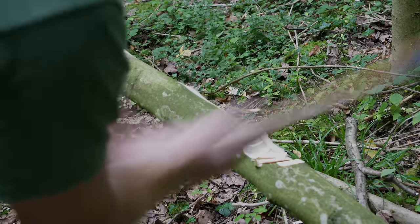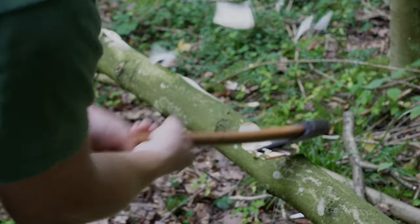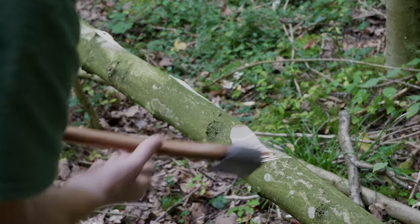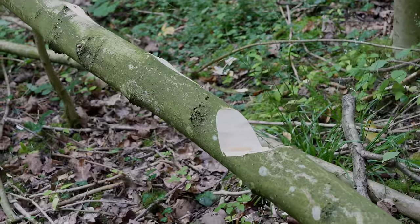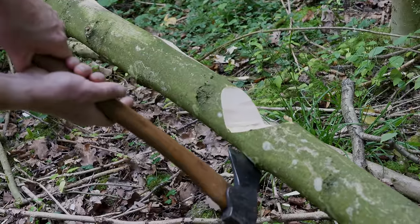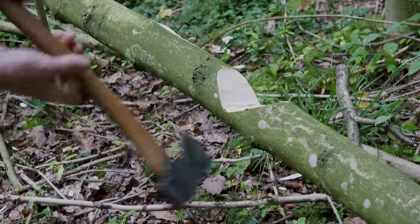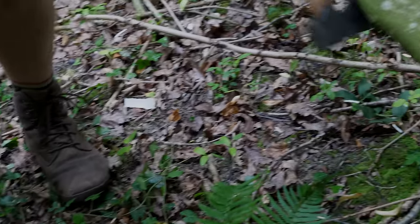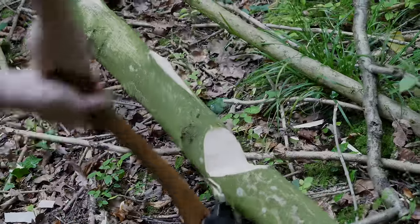It's a little bit shorter and narrower — this is only a three-and-a-quarter-inch cutting edge — so it means you'd have to work across the log if working on a wider piece of timber. In this instance, because it's off the floor, I'll actually be able to take a backward swing like this. My legs are in front of where the impact is, which should prevent any break-out of the timber as well.